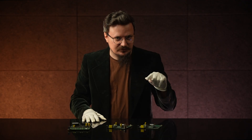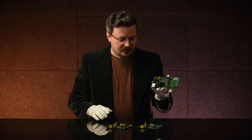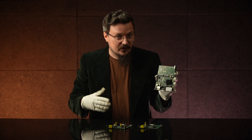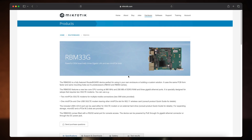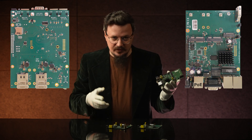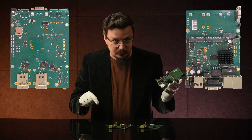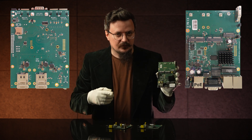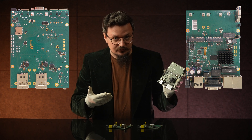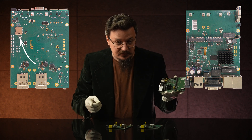For the most advanced DIY people out there, the RBM33G. It might be a cooler gift to some crafty guy than a Raspberry Pi. It features a dual-core CPU, 256 megabytes of RAM, and 3 Gigabit Ethernet ports. There are two SIM slots and two mini PCIe slots, so you can add multiple LTE cards and a Wi-Fi card. Redundancy and adaptability is the key here. You can also add external storage, because there's a USB port and a serial port as well.